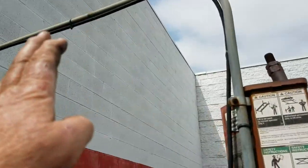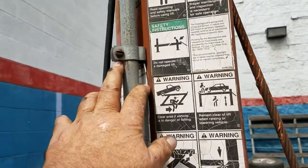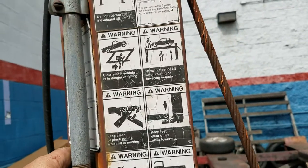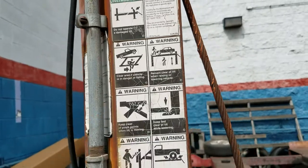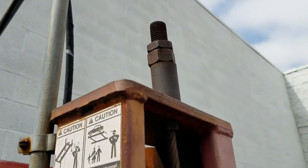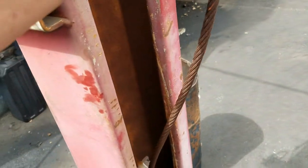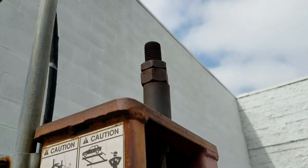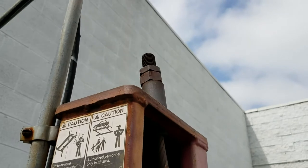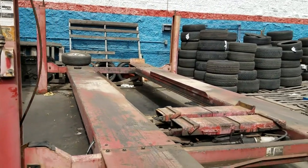The only thing I think I'm going to have a problem with is this rigid line — I may have to disconnect it here, and just leave the power line sagging, then the column will come off. I don't know if I'll have to remove those nuts for the cable — I got a lot of slack in there so I'm hoping I can just lift it up. These can be a problem when they're out in the elements — usually I have to use a torch to heat them up to remove them. This is a four-post rotary lift, twelve thousand pound capacity.